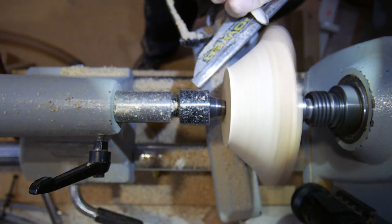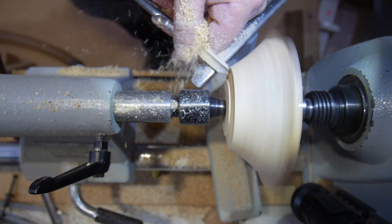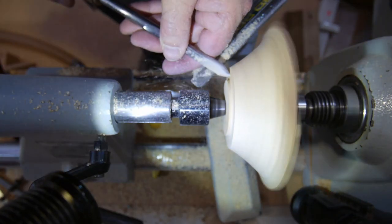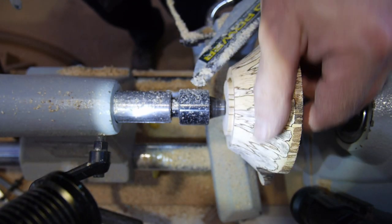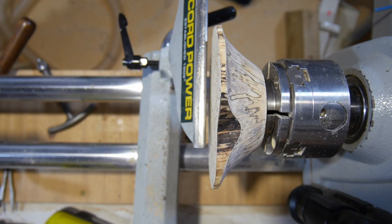Using a combination of a half inch spindle gouge and a quarter inch spindle gouge, and here I am just sizing up for a tenon, my smaller 35 millimeter jaws, I think they're classed as, but you actually have something like a 28 millimeter tenon.